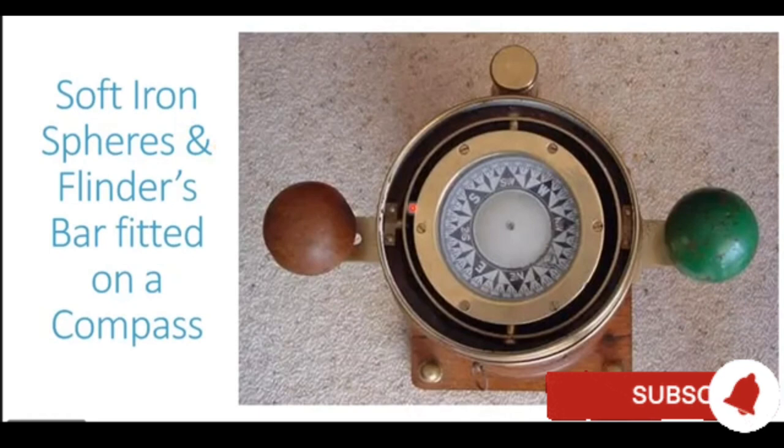So you can see an actual compass with a picture clicked right from top. You can see the spheres placed on either side, starboard side and the port side. You can have a look at the channel also here. You can see a slot provided. This is the sliding channel. There are nuts which are fitted below these spheres, and they can be tightened in location using those nuts. You can also see the flinders bar, which is forward of the compass location.